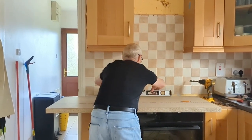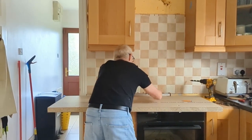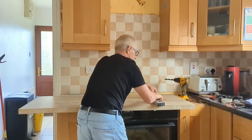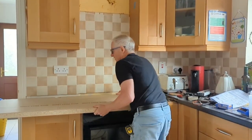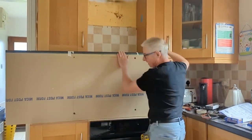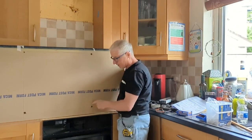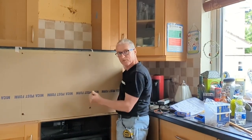I get that guy on there — it'd be better if I put the level the other way. Now, if I just pop the top up so you can see it — you can see the lines now all around there. I've got the pilot holes gone in there, that's allowed the jigsaw to get in. Some people cut them from the top; it depends on the jigsaw blade you have. I prefer to cut them from the bottom — I can marry the lines and there's no danger of chipping on the top, because the jigsaw blade is cutting up the way.